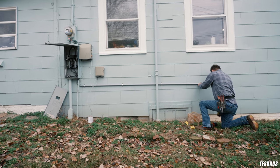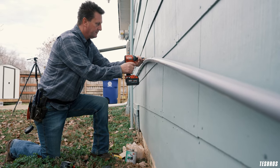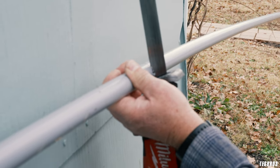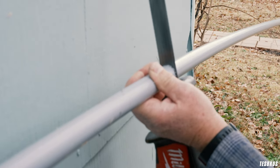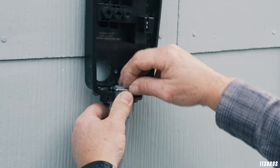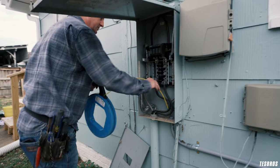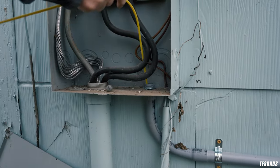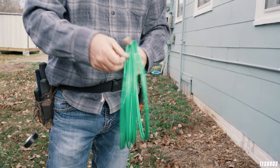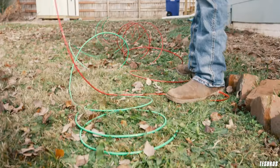We placed brackets about every three feet so there's no excessive weight or tension in one area. My run was about 25 feet all the way across. Once you get to the end, measure, use a sawzall and cut as cleanly as possible — or use a specific pipe-cutting tool. Then add another L-shaped fitting and bracket to connect to the charging bracket, and mount the Tesla bracket to the wall. The next step is feeding a wire feeder all the way across — we had a really fancy one. There are three wires: ground and two hots. The green wire is ground and we had two reds.